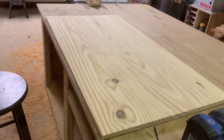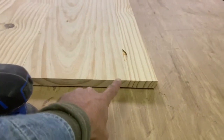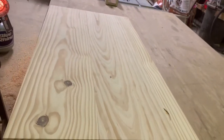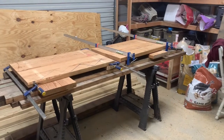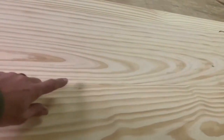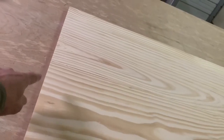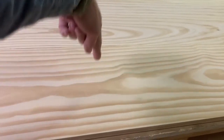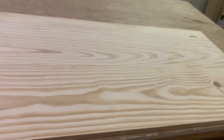So this is the original top for the massive table that I built that was not joined well. I went ahead and finished milling it down and you can see how thin it got — it even got so thin that I was into where I'd cut the holes for the biscuits. But it's nice and flat now. Over on my sawhorses I've got a couple of legs that I've glued and biscuited together. I'm going to drill a whole bunch of three-quarter inch holes in here, evenly spaced out. Underneath will be a tray that has an angle to it that goes over, with a port for my vacuum. The dogs are clamps that have a little straight part that goes down in the hole, and as you clamp them down they pull tight. So I'll be able to use this for sanding and for assembly, and it'll be mobile so I can move it around the shop.